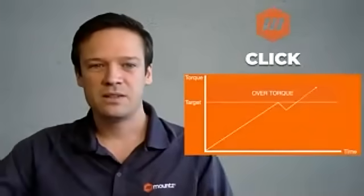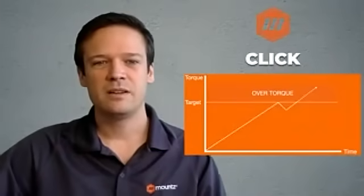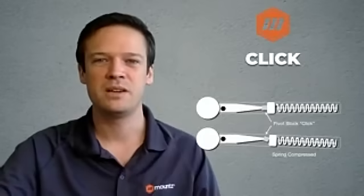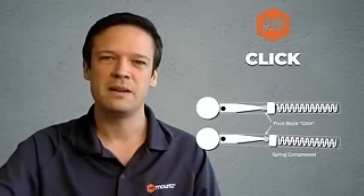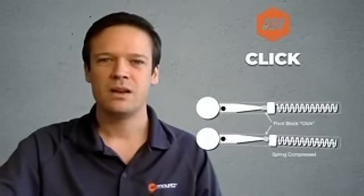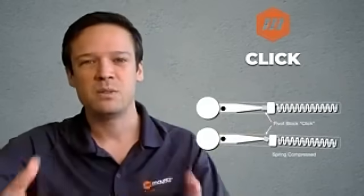Not only that, with click wrenches, but when we look at how those wrenches work a bit deeper, you can see here on this drawing the spring pushing on the pivot block, and the pivot block being basically linked to the head of the tool. So what you can notice is there is a distance between the pivot block and the head, so between the pivot block and the fastener.